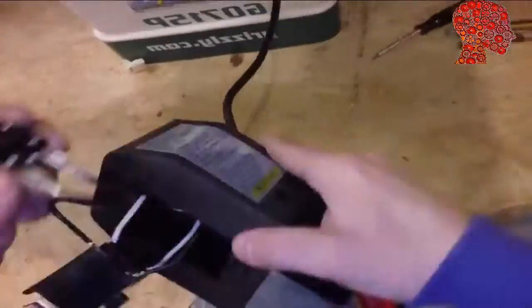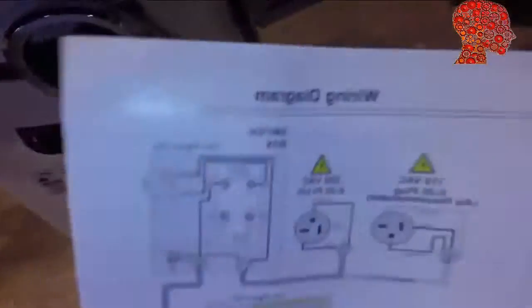Then you open up the wiring compartment on the side of the motor and rotate 2 jumpers 90 degrees to the left and to the right. Finally, you replace the breaker on the side of the switch with a $10 part you can purchase off their website at the same time you buy your saw. It's all in the manual, and you can easily convert your saw over in about 10 minutes.